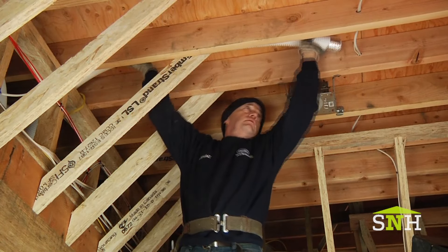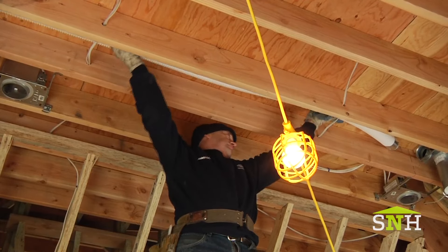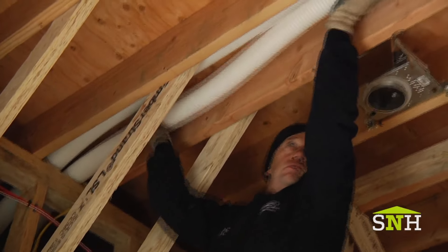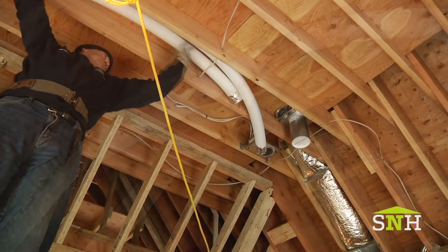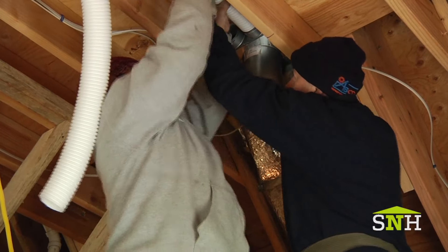A healthy house requires healthy air. Building codes are requiring more and more airtight buildings to prevent heat from leaking out. When you make a building virtually airtight, you have to have mechanical ventilation — you can't rely on windows in a cold climate, or your heating bills will skyrocket. A heat exchanger does a wonderful thing: it uses the stale air and the heat in it to pre-warm the incoming cold air. The airstreams are never mixed, but the temperature gets transferred from the warmer stream to the cooler one.